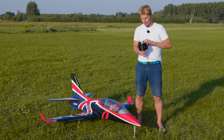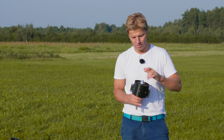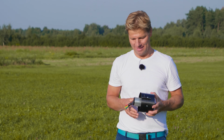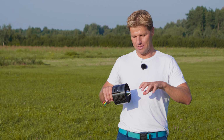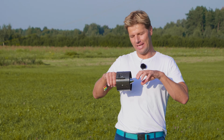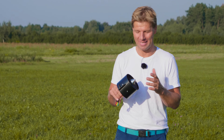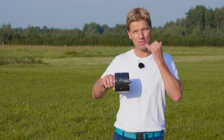Yeah, and I have to say a few things, because even though I was away for the summertime, I was still following your YouTube channels and your projects, and I saw a few of you building new jets, and you buy expensive drives and expensive planes and set it up together, and then I saw a few times that you put the batteries or some other obstacles just in front of the EDF. It's really kind of pointless to buy a super expensive EDF, this one is actually not expensive, but other expensive ones, and to place a battery straight in front of it, because you ruin the efficiency.